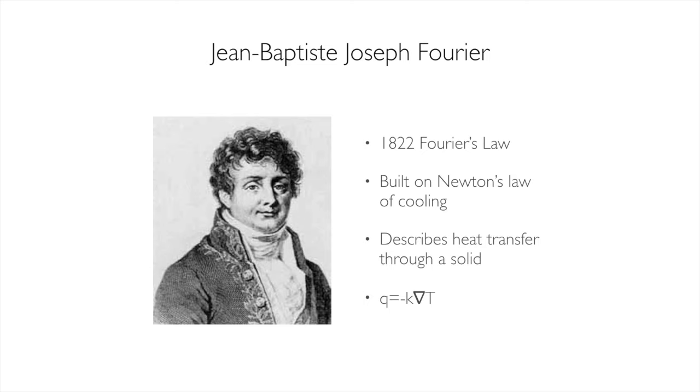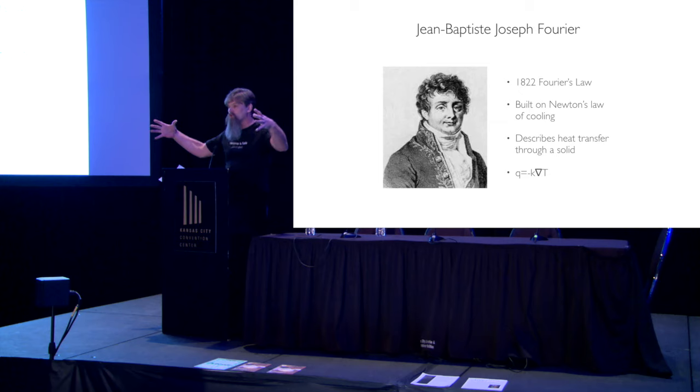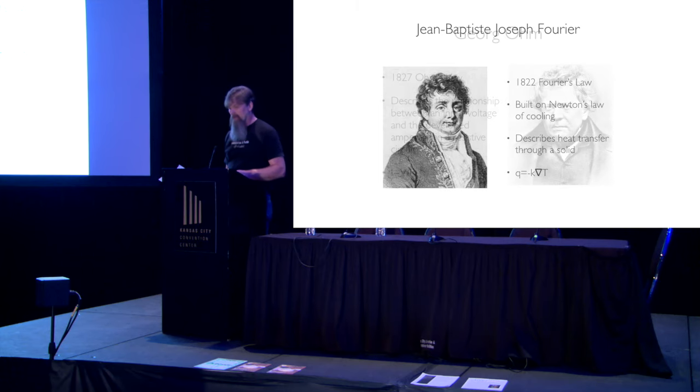And this funny little upside-down triangle T, which stands for vector temperature. That is a measurement between what is the actual difference between the hot face and the cold face. What this helps us to understand is why a kiln that's cooling off drops the first 100 degrees like a stone, but that last 100 degrees, man, that's forever. You're just waiting. This is why, because as that vector gets closer together, it slows down. He proved that this is true.